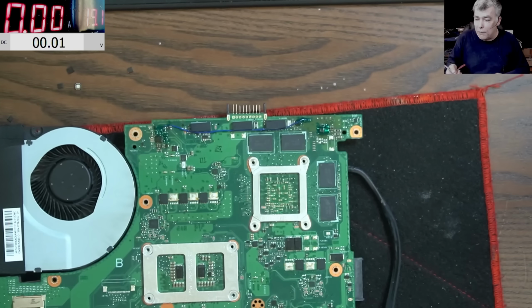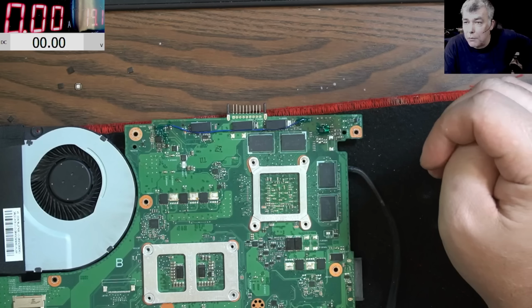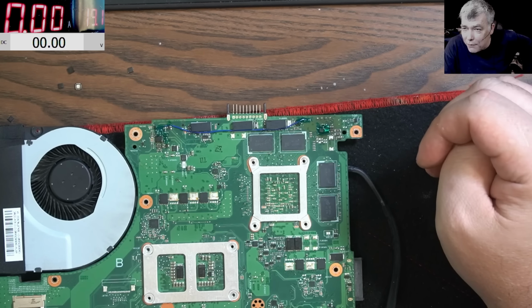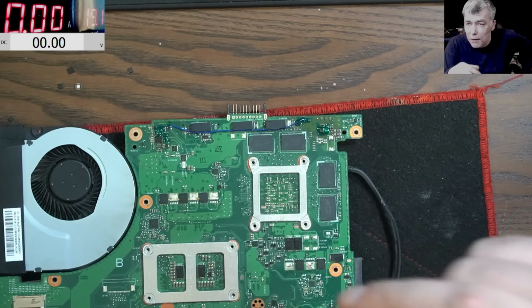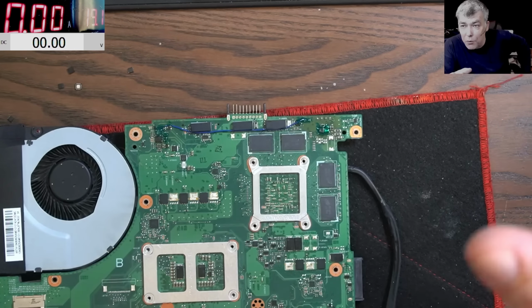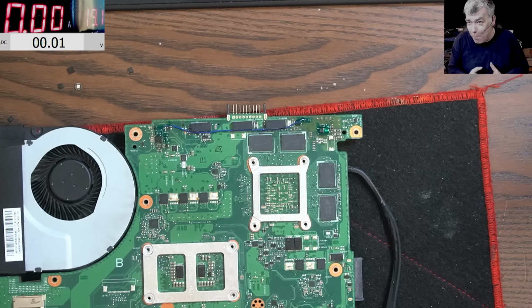So actually I do have like 5 volts here and here on both MOSFETs. I mean, insane. I never ever had this fault before. I mean, these tracks to be broken from the power management chip here. And every time I try to start a video and do a nice beginner's tutorial, it ends up being a mad, crazy job like this one.